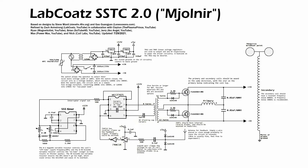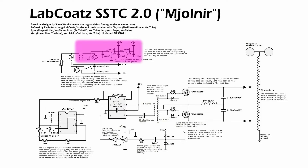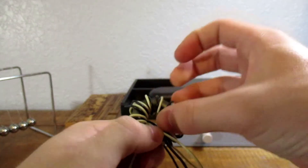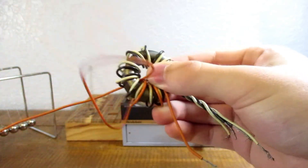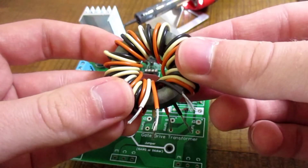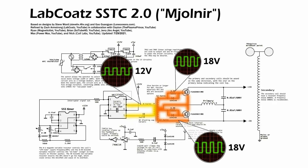All this low-voltage circuitry is powered by a few simple voltage regulators, which take any DC voltage from 14 to 24 volts and adjust it to fit the circuit's needs. The resulting interrupted signal from the gate driver circuit is finally sent to a gate drive transformer, or GDT. The GDT can easily be made by wrapping two 12-turn coils and one 8-turn coil onto a suitable ferrite core. When properly assembled, the GDT converts the 12-volt signal from our driver circuit into two 18-volt signals, which are optimal for switching the transistors.